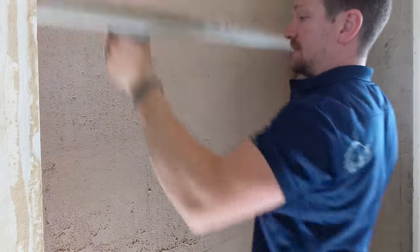Now we're applying the top coat — this is probably the easiest stage of your lime plastering journey. All we're going to do is load up a small amount and just trowel a thin layer across. We're looking for about two mil, and what this is going to do is take any lumps out of the plaster but also fill the key that we've created. It's going to sit nicely into the bond so when we're applying the plaster it's not going to move around.